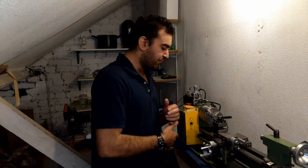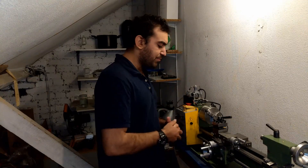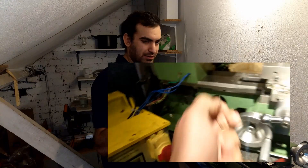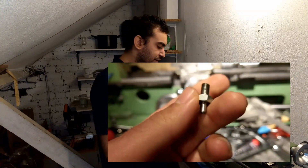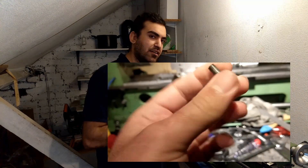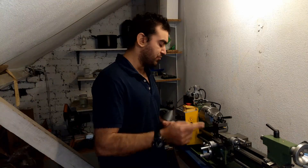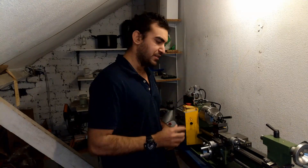After I drilled the bed, I added a small piece of pipe — it was basically a screw I drilled through and made into a pipe — and then I connected some tube to that drain point to recycle the oil and collect it into a small reservoir.